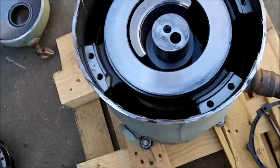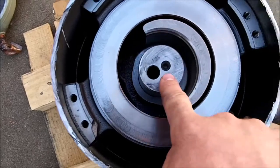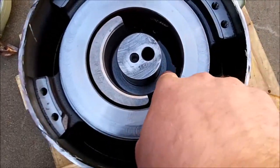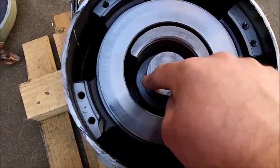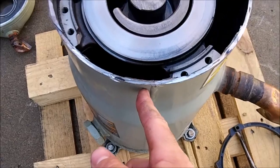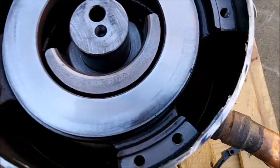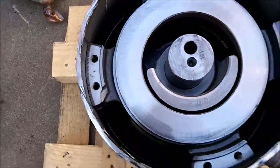Here's what the crankshaft looks like. You've got your big counterweight and your eccentric right here. You can see where the center is — that's the pilot hole where they put it on the lathe to machine it. Then you have your eccentric hole, which is also an oil gallery that provides that bearing with oil. There is also a bearing underneath here, which I will not be showing you because to remove it I'd have to press off this counterweight — that's just too hard. So now I've got to cut somewhere around here and hopefully the whole bottom pump assembly will just drop out. Looking down in there you can see part of the motor stator, that bronze-looking thing. The camera isn't picking it up well but the wires are right there and they go to that plug. Let's continue dismantling it.